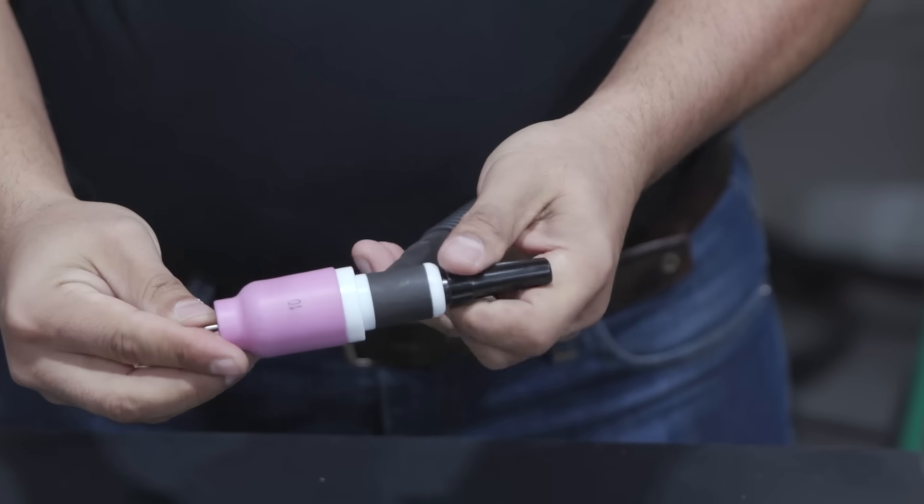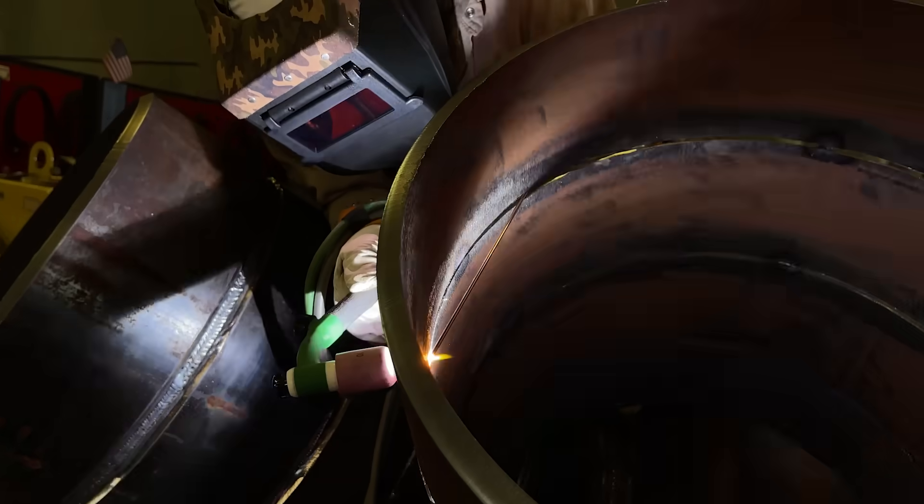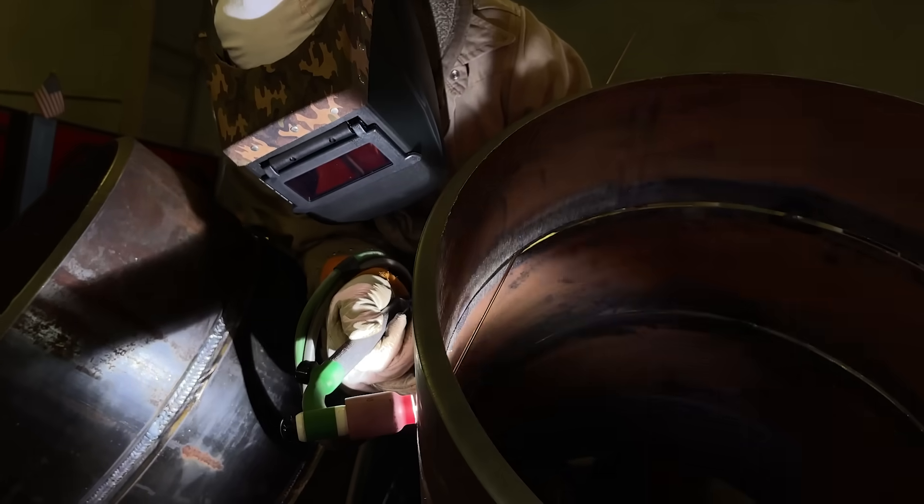Your good old tungsten — but for this to work, you actually have to cut the tungsten in half. This setup here, you're actually going to see it a lot in industrial settings, refineries, fab shops. It just works that much better than the first one because it diffuses the gas better and gives you better coverage on your weld pool.